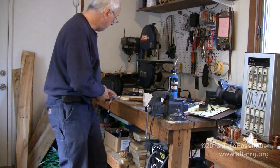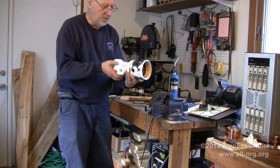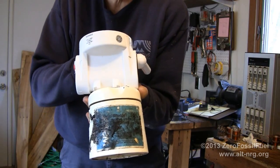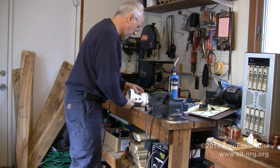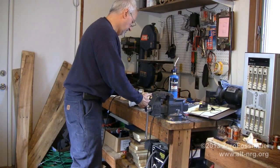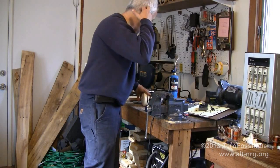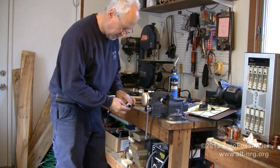Okay, so here I am in the shed. I've got my old water filter head, my new water filter head, and you can see it is readily apparent how much difference there is between the spacing of the inlet and outlet openings and how much I need to remove from the copper pipe. Which best guess is about 1 inch, maybe 7/8. I'm going to go with 3/4, only because if I need to remove more, I can remove more. If I need to add some, that's a little more difficult.